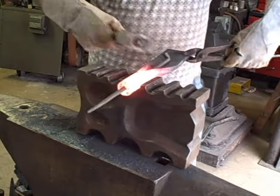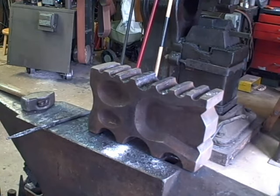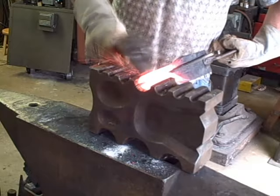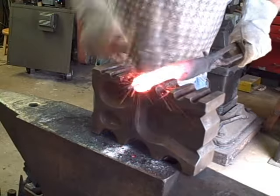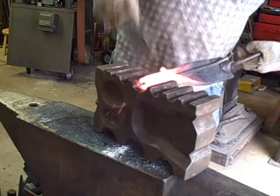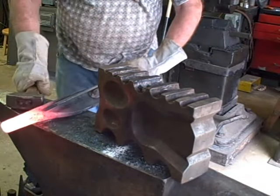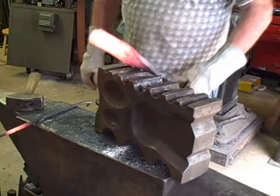The hole that you end up with after all this forge welding is not an even hole — it just needs to be a hole so that you can get a boring tool, a drill, in there. That's how far the mandrel should be pushed in — just a little ways. You're only seeing part of the forging here; most of the video is speeded up to three times normal work rate. There's about four hours of forging in total in this project to this point.